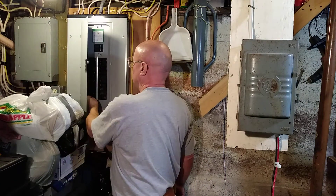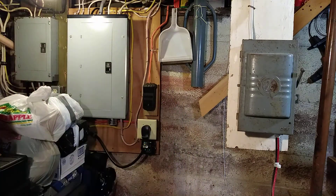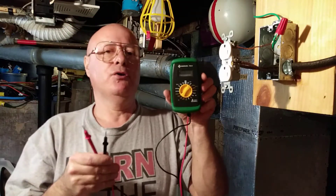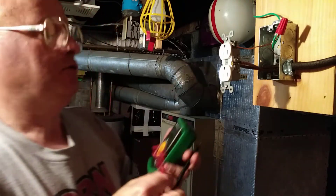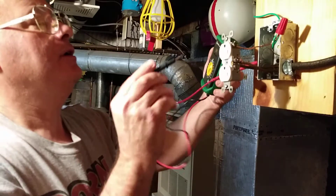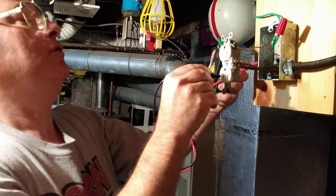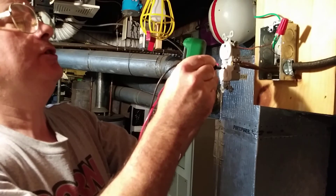We'll come over and turn our circuit back on. We'll check it with the voltmeter and verify everything is working the way it should and that we have the ground. Using the voltmeter on 200 volts, we take one lead to the ground and check the live side of the outlet — 120 volts. And again, 120 volts here and 120 volts here. So now we do have a grounded outlet.